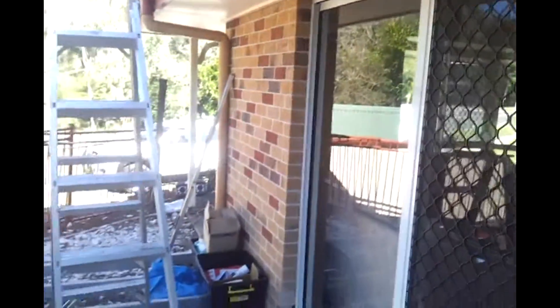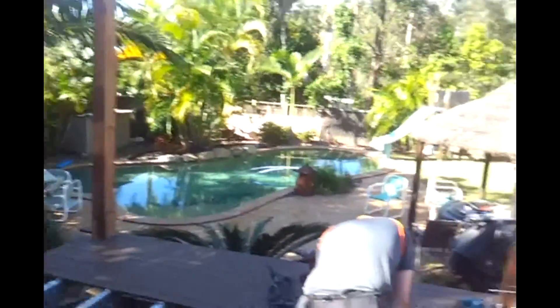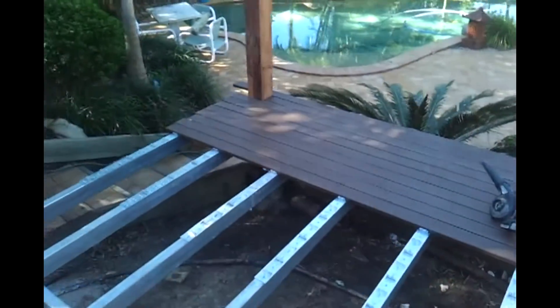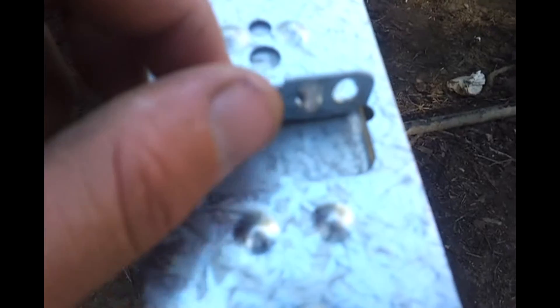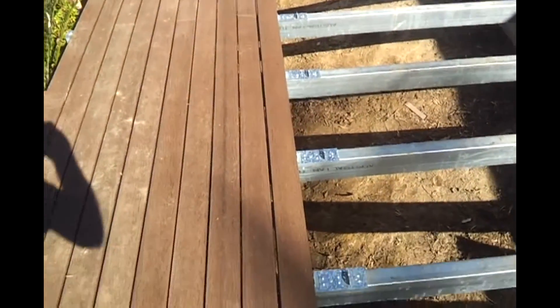Progress for today - we've got three massive 140 by 140 posts installed, and we've started putting our decking on. A new product we're using is a clever clip system. What Andy's screwing down here is a series of metal clips - like metal spikes. If you zoom right in you can see there are two little sprigs there, and they clip into the side of the groove on the Modwood there, so it clips in nice and tight. It's quite easy to install.